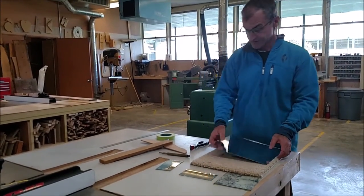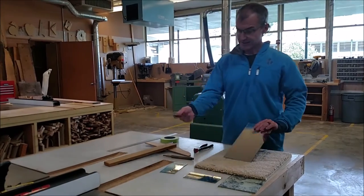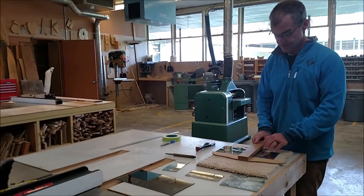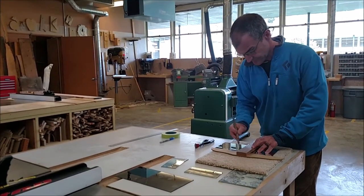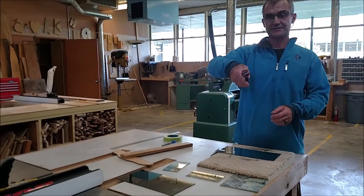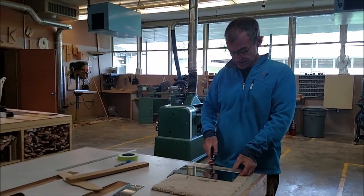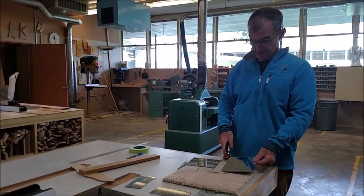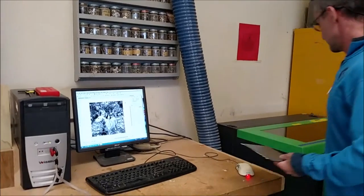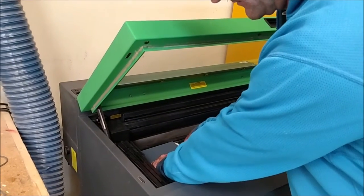With that offset I'm right on the blue marks, and then it should just break right on that line. I don't want to stack any glass because it'll get scratched. I do that one more time to get my six-inch square. These are glass breaking pliers specifically designed for this — you can see the convex and concave; they bend up so the convex goes right on the score line and you just gently squeeze. Six-inch glass with a little tape on it to keep it protected — just 0.08 inches thick.